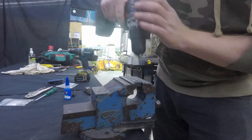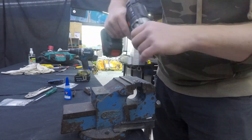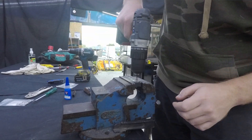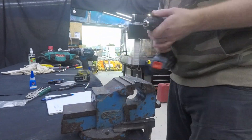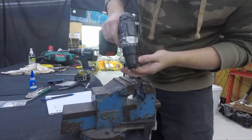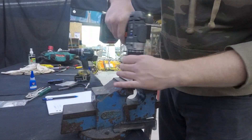I'll quickly describe what's going on in this test. Basically, I've used a cheap cordless drill and increased the clutch setting to see how much torque it takes to make each insert slip. We've got five of each, and then I can compare the averages to get a pretty good idea of how much better the nutserts are than the brass inserts.